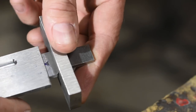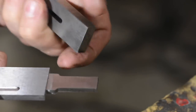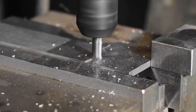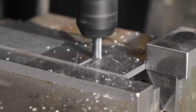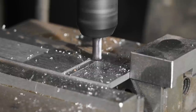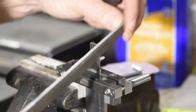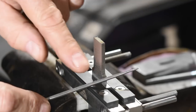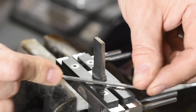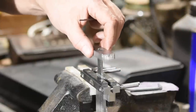Before I shape the blade I'll perfect the joint between the cross guard and the blade. It comes off the mill one or two thousandths of an inch out of true — that doesn't sound like much, but it's painfully obvious as a large visual gap. If it's not fixed you have a little dark line running along there. So I'm hand filing it here using a filing guide; my file's been modified to include a safe side ground flat so that it just skates on the carbide, which otherwise would trash your file pretty quickly.